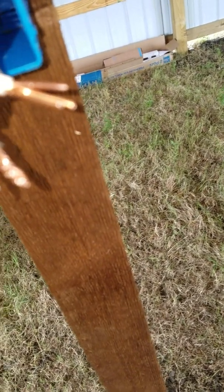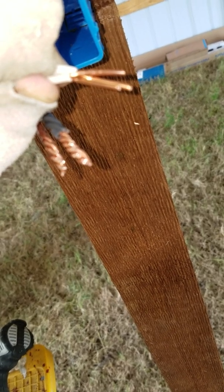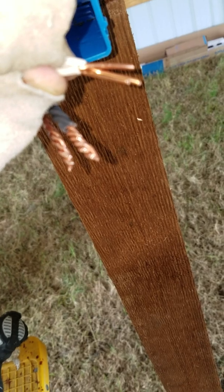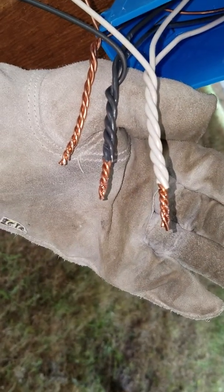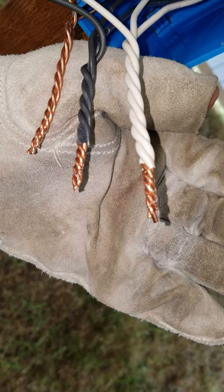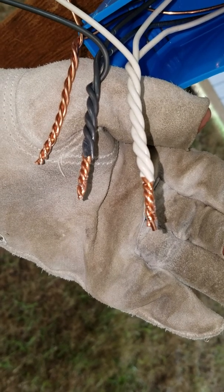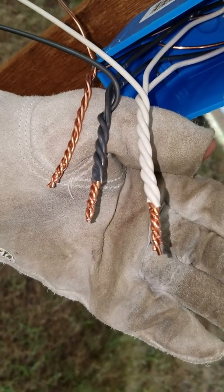I just started to twist them together. Now I'm going to make this splice — I'm holding my fingertips like the bottom two. See all the ends being so close — you don't see any overlap of the insulation in the copper wire, and that's a sound mechanical joint. It's tight, it's not going anywhere. And we'll go to folding next.